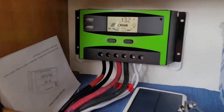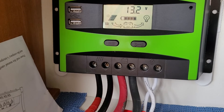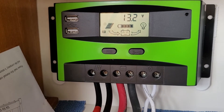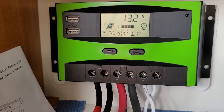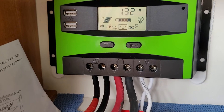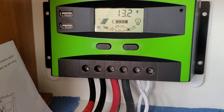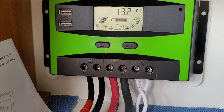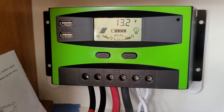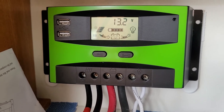As you can see right there, there's a solar controller. The two wires on the right are wired up to the accessory part of the controller, and the black button on the right is actually to turn on and off that accessory, so we can turn the fridge off and on from there. The two wires in the middle go straight to the battery bank to charge your batteries, and the two black wires on the left are the incoming power from the solar panels. There are also two USB chargers right on the controller — a nice bonus for all our electronic gadgets.